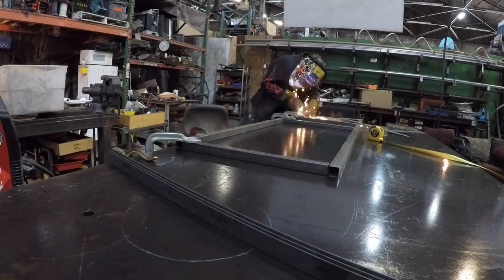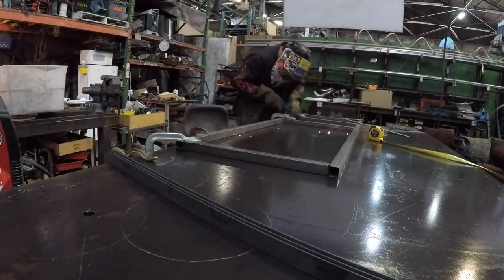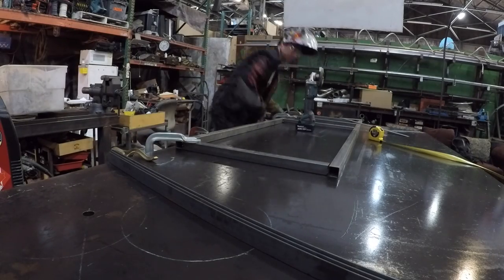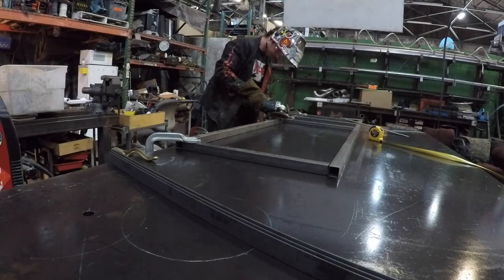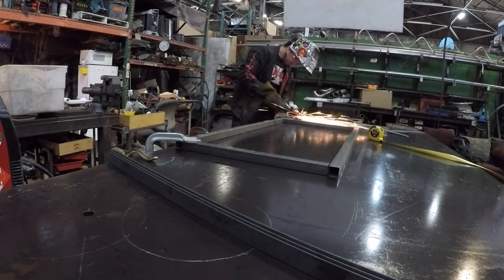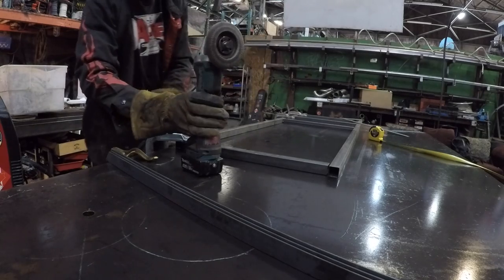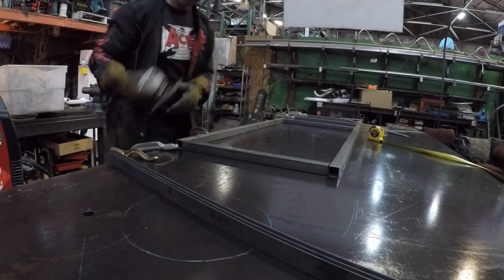The welder's probably running a little hot right now tacking it together — I kind of think hot tacks are a little better. I decided to just put together a little box frame with a couple of spreaders at the top, basically just a simple box frame. Making sure to grind down the tacks before I flip it over, otherwise they're going to sit proud and make it bow out when it sits on the table on the other side. Never ever set your grinder upright.